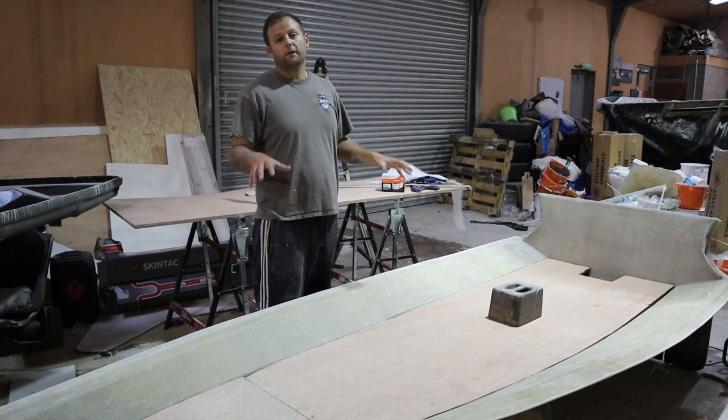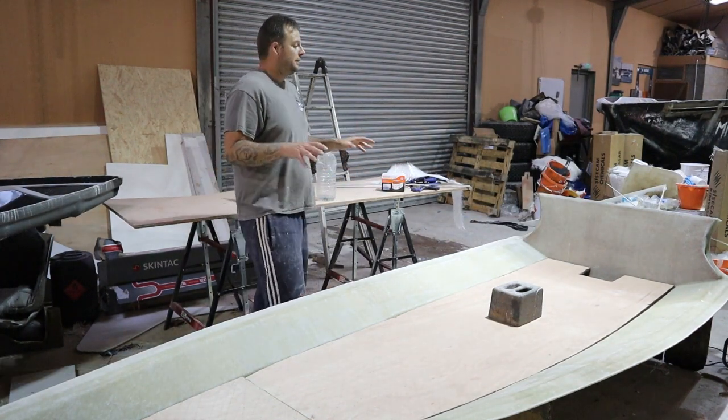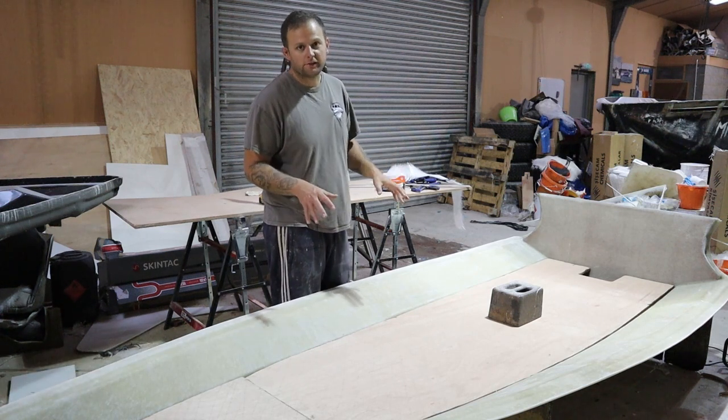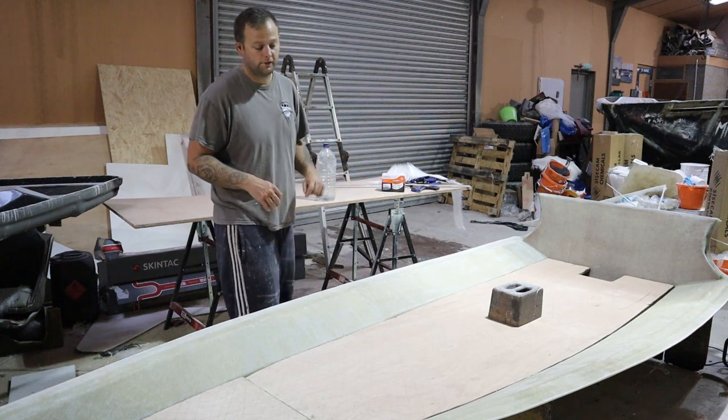Moving on now, the underside of the deck has had fiberglass and resin applied, okay? So pre-trim the deck before you get to this point, much easier, and then you're not making any fresh cuts into the timber, especially where you just sealed it with resin.